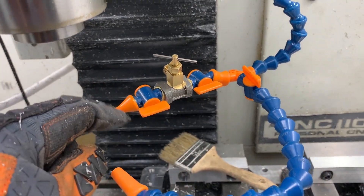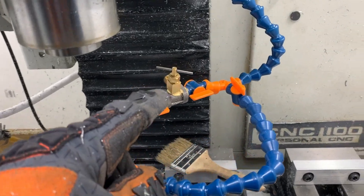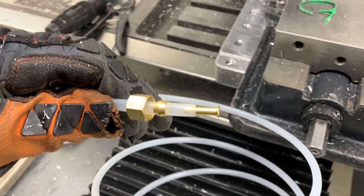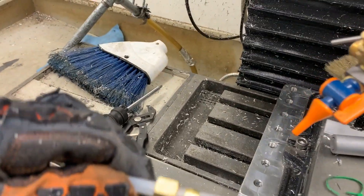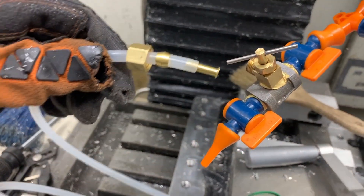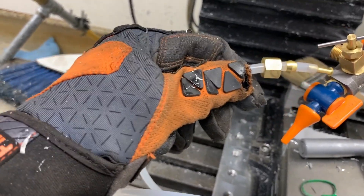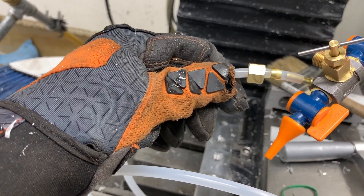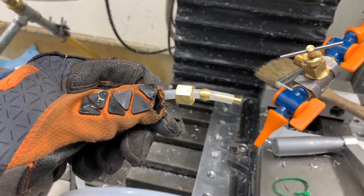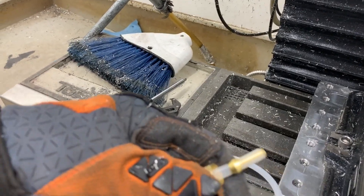This is like a super cheap build — almost all these parts I had sitting around, so this is good. Just a quick note here: if you're going to use poly tubing and a compression fitting like what comes on the end of that needle valve there, you've got to use the little adapter that they give you for poly tubing — that's the piece that I'm pushing in right there. You've got to use that to make sure the compression fitting works correctly.